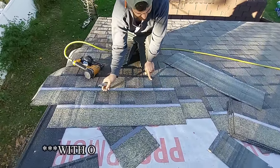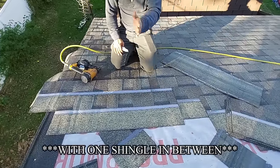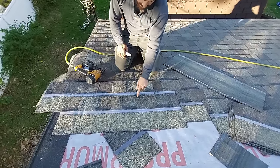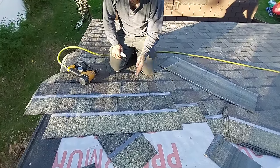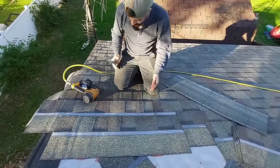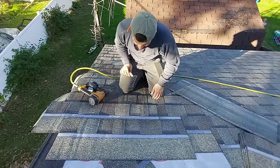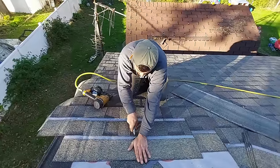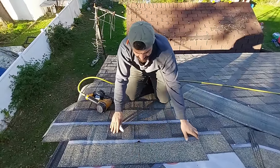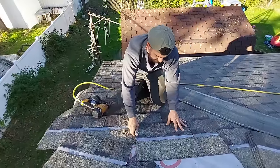And don't worry about the fact that it's almost stacking another seam. You can get in trouble if you stack a whole roof like that. You don't want to do that with these architectural shingles, these laminated ones. That's a big no-go. All right, but if you do it once, randomly, five random times, maybe, you're going to be okay. That'll never be the cause of your problems on a roof, as long as you watch your nailing, you don't have those surprise nails in there.